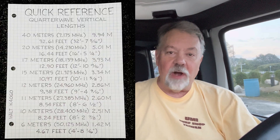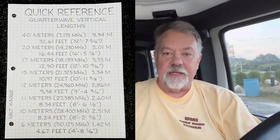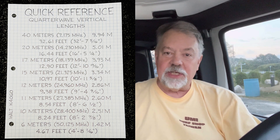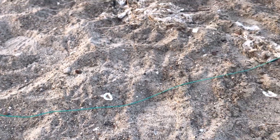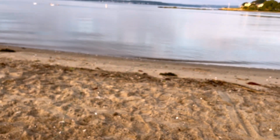I've put together a cheat sheet — I've gone through all the bands, the middle of the SSB section I operate on, and I use this cheat sheet to build mine. It's a real simple antenna. We're just going to put a quarter-wavelength piece of wire up vertical, tape it to a pole, and use a balun at the feed point. You can use a simple banana clip. I'm at the beach, so just one counterpoise going right into the saltwater. Mine's probably 17 or 18 feet long — length doesn't really matter.